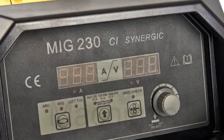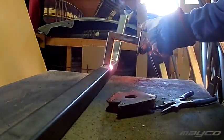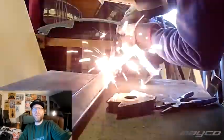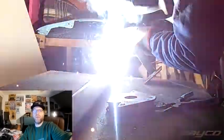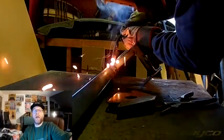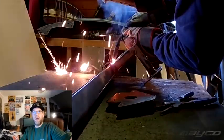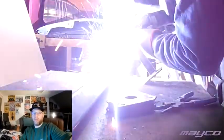There is also a button you can push to fine-tune the voltage slightly while welding. For example, one person might like to weld at 24 volts and 100 amps, and another might keep those 100 amps but go to 24.5 volts — so you can manually override the voltage while the amperage and wire speed stay the same. There is also the fully custom adjustable option found mostly on professional machines, where you can independently change wire speed, amperage, and voltage.